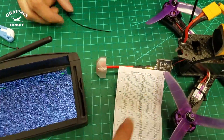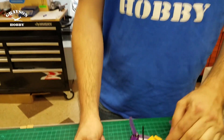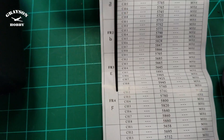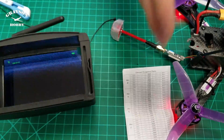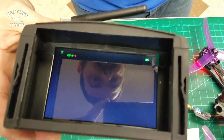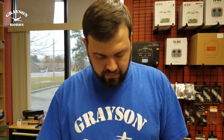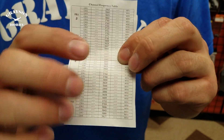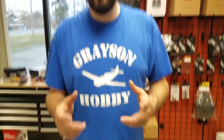As a first-timer, how do I get my goggles and my brand new upgraded VTX on the same channel? In this case, we're going to use a known band frequency. The F band is Fat Shark band — channels one through eight. Simply put the VTX on F1 and put the goggles on F1. On the EV800, just hit search, but make sure it's actually pulling up on the F band because sometimes they pick up on adjacent channels that bleed over. Keep in mind the numbers — for some VTXs, F might actually be labeled E, and E might be A, or something like that. Just look at the numbers; the numbers don't lie. If you're using the same brand, they're generally going to line up.